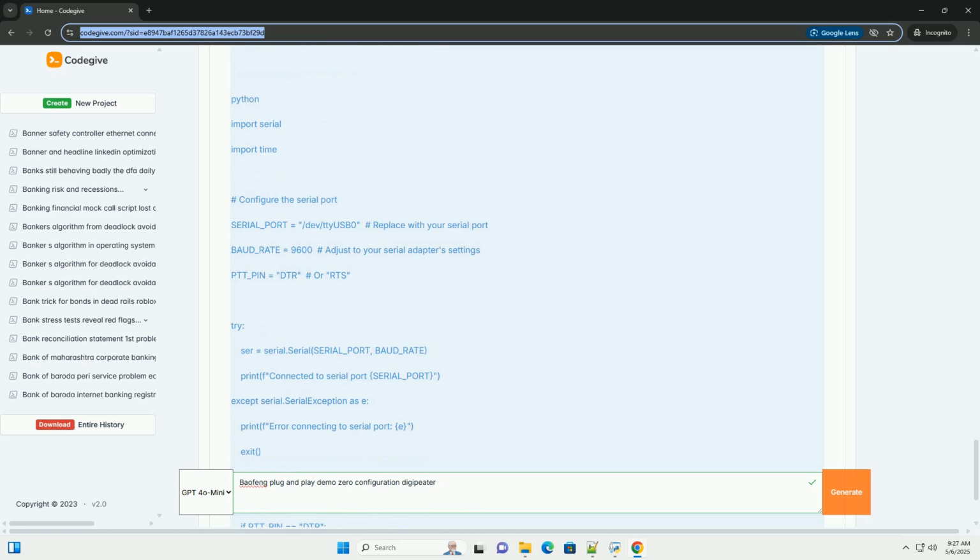7. Configure audio: edit the /etc/asound.conf file to configure the sound card. If you're using the built-in audio, it's usually card 0. If you're using USB sound cards, identify their card numbers using aplay -l and arecord -l. Configure asound.conf something like this. You will need to configure the transmit audio separately, or combine the configuration. Important: setting the correct sound card numbers is crucial. Incorrect settings will prevent Direwolf from accessing the audio devices.